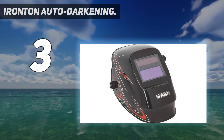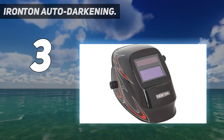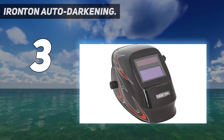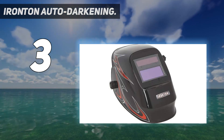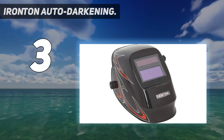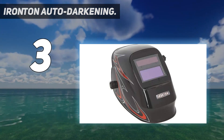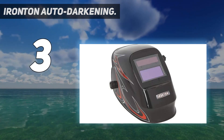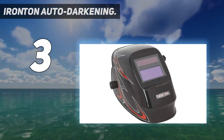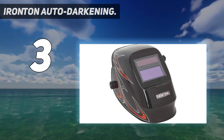The ADF uses older technology without a true color feature or other technology that improves light and color transmission, so expect to see quite a dark image. When welding in a well-illuminated area, you cannot decrease the sensitivity to prevent false activation. Also, the battery is not replaceable, but it should hold out for the two-year warranty period. Plus, there is no low battery light indicator. The helmet has only two arc sensors, so you can get flashed if welding in cramped spaces.